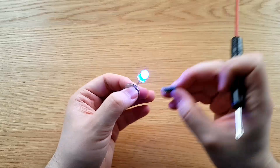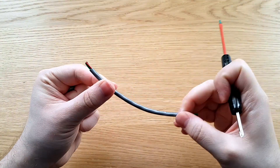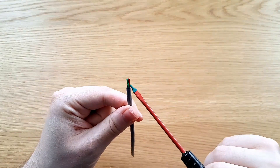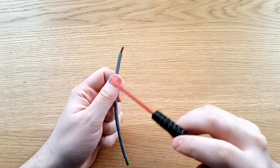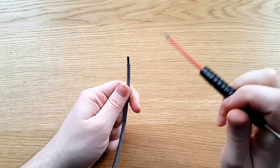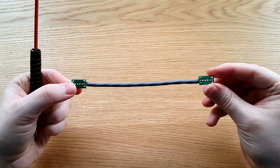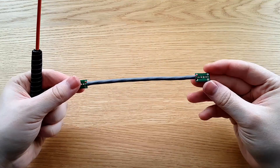Essentially we're going to put a bunch of these onto these little circuit boards, and then we're going to connect them together with this three-conductor wire. The big reason that I wanted to go with the Neopixels is that I only need three-conductor wire, which saves soldering one extra wire per LED. Ideally we'll have a bunch of chains like this where they are all connected in a line.